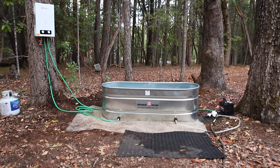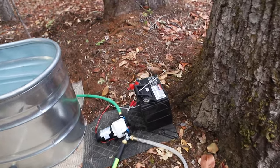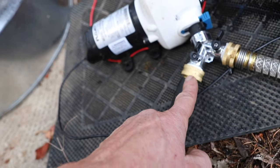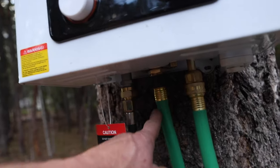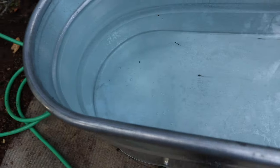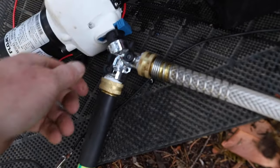Here's a quick recap of how I hooked it up this time. There's the pump house — hose hooked up to the pump house, runs into the pump or into a splitter into the pump. Water goes as a pass-through because it needs to go in the right direction, through a hose back there and directly into this tankless water heater — that's the cold in. Then it's coming out here, hot water coming into the hot tub, and it's bubbling and it's hot. It's pretty much full, so I'm going to turn it off now and switch to recirculating mode — water comes out of the tank already warmed up, into the pump, and just recirculates.